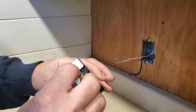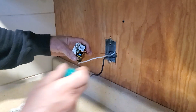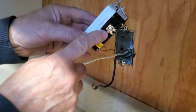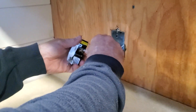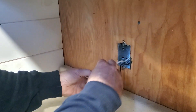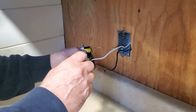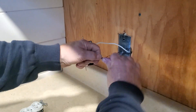This one right here, we're going to go ahead and put the ground wire back on again. On this side you'll see that's a brass lug, and on this side this is a silver lug. The silver lug denotes the neutral. I'm going to have to re-bend that. There we are. And the last one to go on is what we call the hot wire.